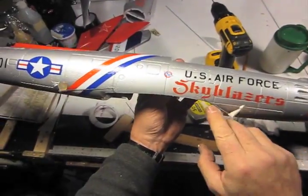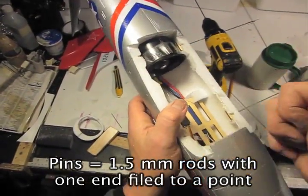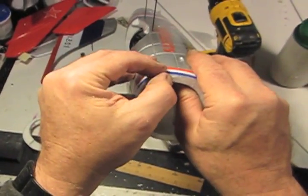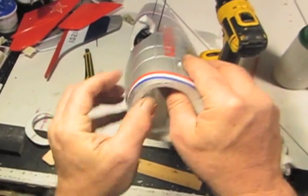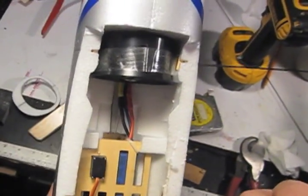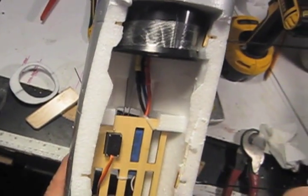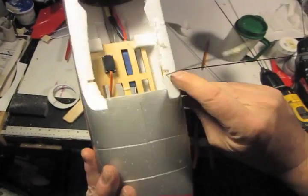And the lower side rods, you're going to put pins in just under these wood plates on this side, and then sight down those pins to the front. I missed it here. It needs to be right next to that hole. And then drill along there until you get to the second one. So you're going to actually aim for this side of the wood plate right here, so that your rod goes on top of it. And you aim for the pin right there on the inside side.